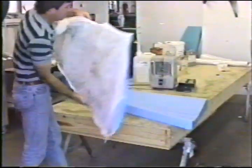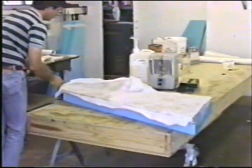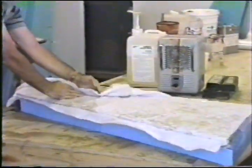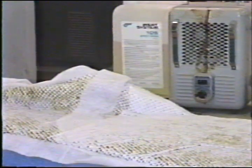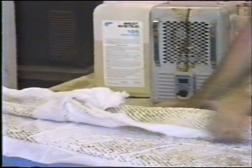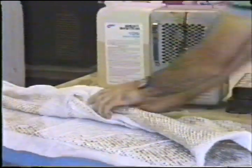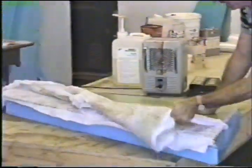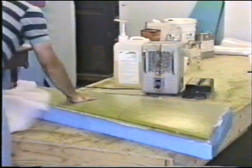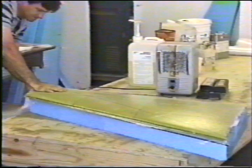We removed the vacuum last night after it had reached the point where the resin had gone beyond what we call the B stage. The B stage is that point that the resin can no longer be considered a liquid. It's a plastic, albeit it may be a soft plastic. It will no longer allow glass to expand to suck air back in.